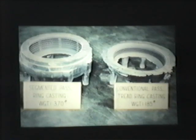So this one's going to separate at right angles, and this one's going to pull. You're going to have another one. As a matter of fact, you can just take another one made just like that, flip it upside down and put it on top of that. You've got your full one. That's off, and now it's done. So this is cheaper. This costs $20,000 to make the mold this way. It costs approximately $40,000 to make a mold that way. That would be Canadian funds, I think, but probably pretty close to the US.